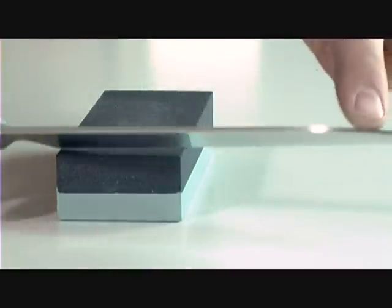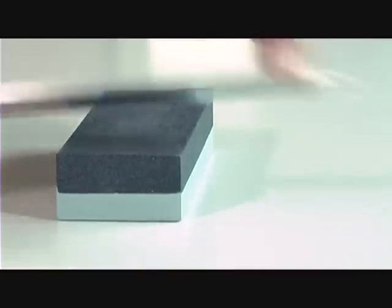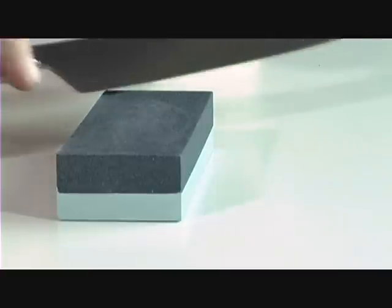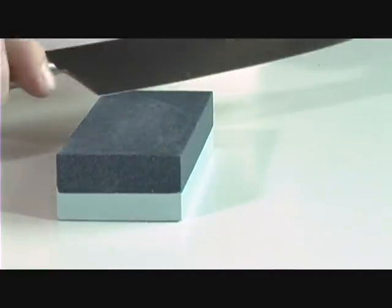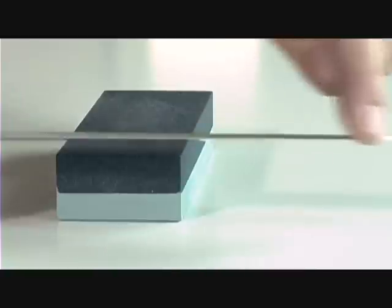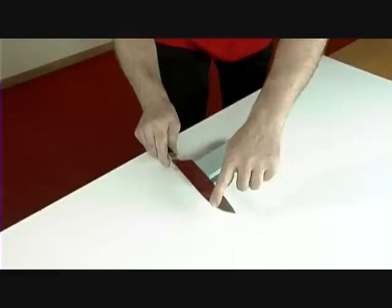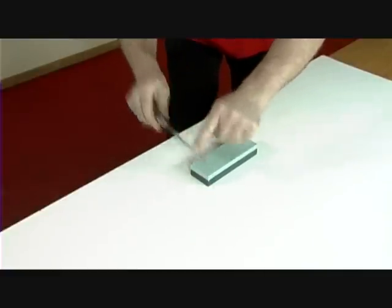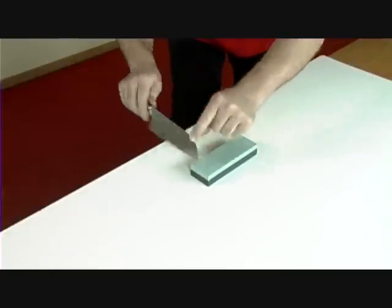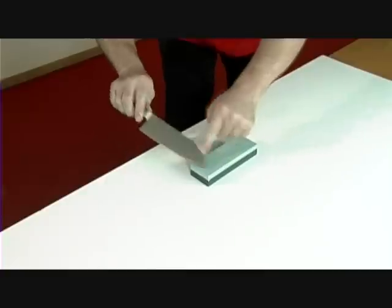Working with a manual knife grinder gives the opportunity for other kinds of grinding. A sharpening steel or sharpening stones can be used according to taste and what one is accustomed to. The rough grind is effected on the coarser side of the sharpening stone. The blade is drawn evenly over the stone, in small circular motions, alternating between one side and the other. Then the stone is turned round and the cutting edge is smoothed on the fine side. The angle used with a sharpening stone is also 20 degrees.